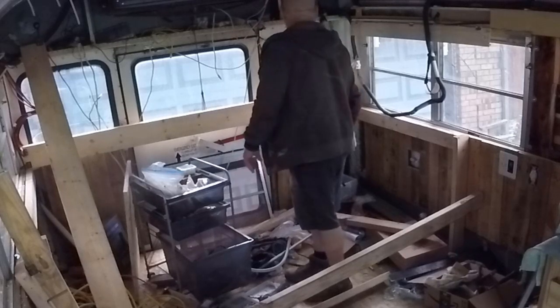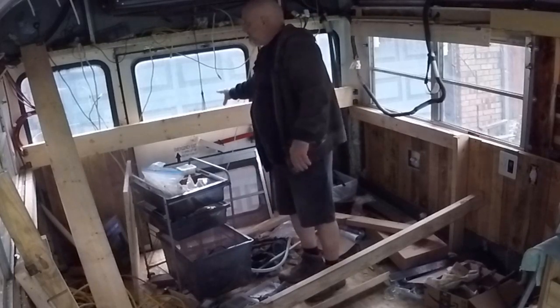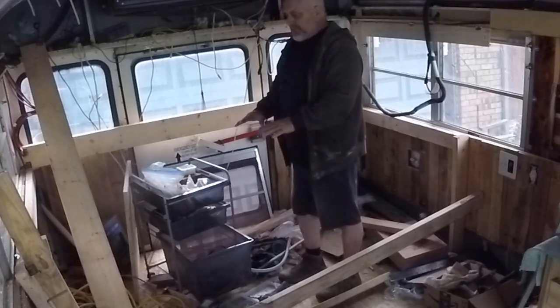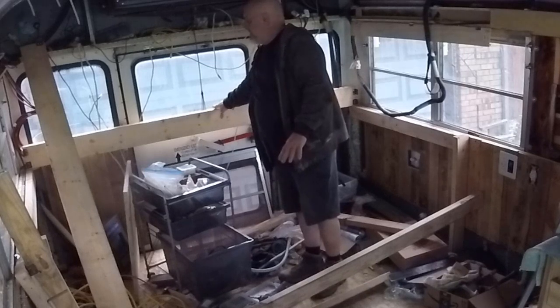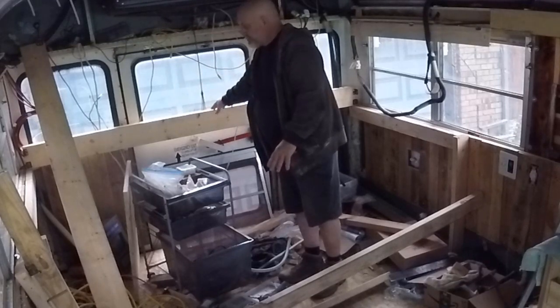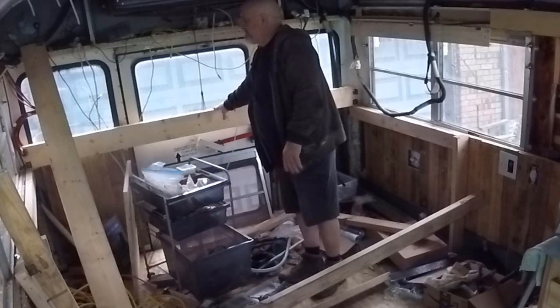Another thing I've got to make sure of is that when I get ready to put the top piece on, the hinge for the top piece goes on this board here. I think there's 2, but I'm going to add 2 more probably. I have 2 pieces of 1/2-inch plywood, and the hinge is going to bolt to the bottom piece. The reason I'm doing that is the top piece is going to hinge in the center to form a couch. It'll have legs or something on the back side of it to hold it up. Then you just take those legs out and it drops back down into bed form. But if you bolt the hinge into the top one, you can't do that. So it's going to be bolted into the bottom one. I may have already done that on there because I've already had this thing up once.